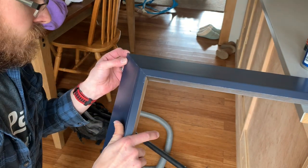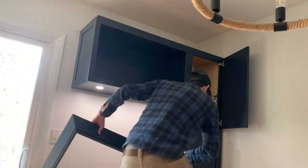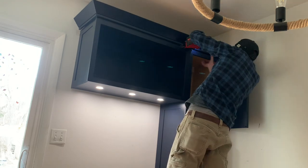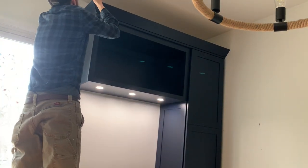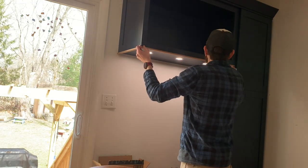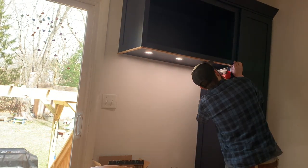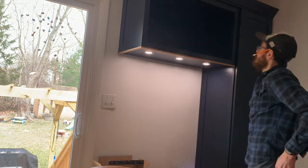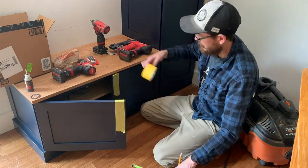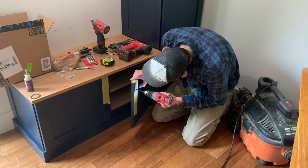There's my pre-finished crown molding — I pre-cut it and had to trim the ends to fit the exact dimensions of the upper cabinets. With a little bit of Star Bond super glue to bring that miter tight together, I just set the crown right on there and pin it in place almost like a little hat. We're going to have a nice reveal across, even with the door, bringing that reveal all the way around the side of the cabinet. For a little added element, I'm going to add an oak light rail trim just to tie it in with the seat bench. I feel one of the trends I'm seeing more and more in cabinetry is mixing painted elements with wooden elements — not just wooden tops and painted bottoms, but having wooden elements in the cabinetry itself.